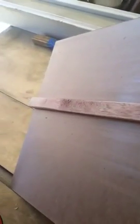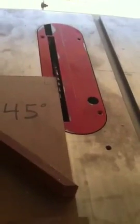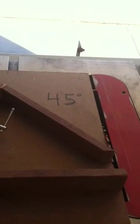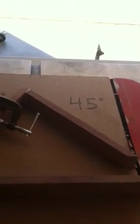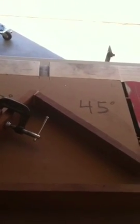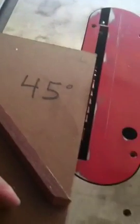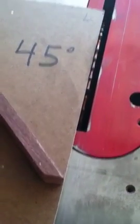This is just a piece of quarter-inch hardboard — it's got a rail on the bottom, and that's probably about a foot or so wide. It's just long enough to fit on both sides of the blade. Nothing terribly sophisticated. I started with an oversized piece of hardboard, put this in at 90 degrees first, and then measured my 45s after I got my gap that I wanted.